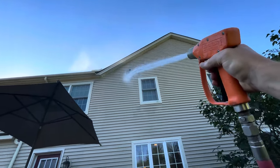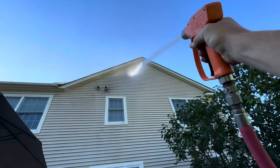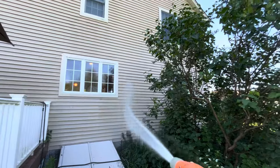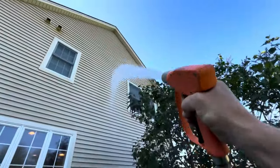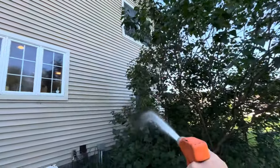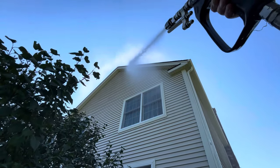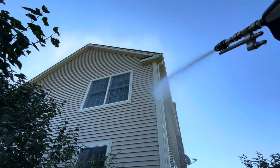Sometimes you get on these projects and you get lichen all over something and it ruins your day if you're trying to downstream it and get it to come off. You've got to apply multiple times, try to hit it with some pressure, and then you never really do get the result that you want. So if you have the ability to pre-treat with a 12-volt, it makes your life easy and you produce a much better result. I'm sure you can't see the lichen anymore — it's liquefied jelly, turned white and slides right off very easily now with the M5 rinse.